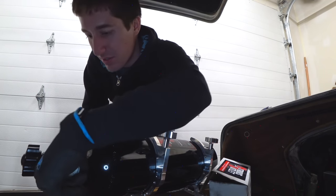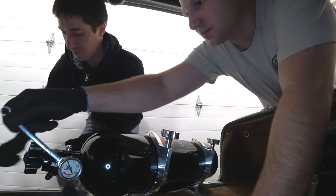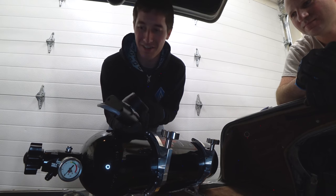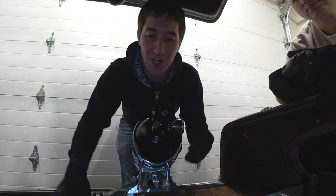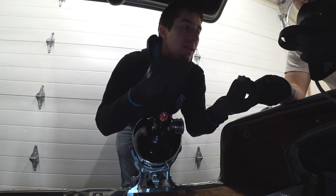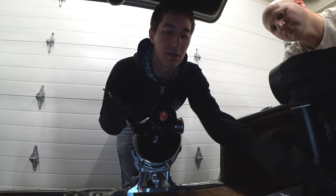What size wrench do you think that is? Seven? I'm gonna guess a 10 or a 12? 7/16s. National pipe thread, not international. Our bottle opener — here's how to install your remote bottle opener. Pop off the cap that's on the end of your valve here. Of course I already scratched it — pop that guy off, just like that. Leave this nylon washer and we'll install the collar here. The collar needs an Allen wrench to tighten it down, and it should probably go straight up and down.